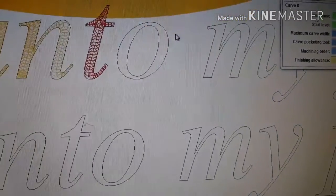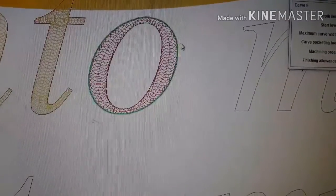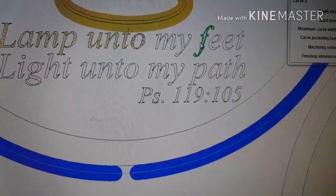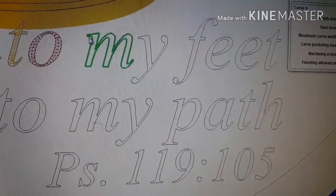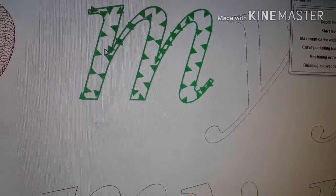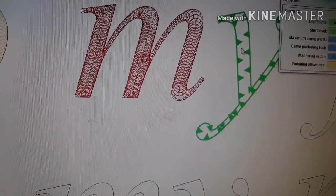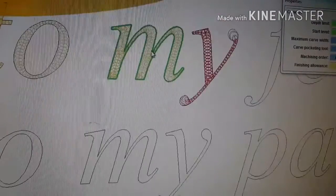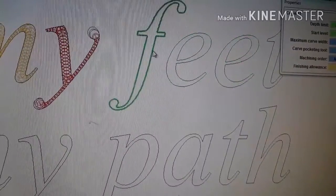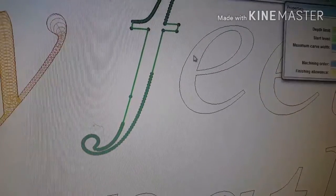And if you don't know what the carve feature is, it's a feature that probably gets used the most for this kind of stuff, like signs. This is a really good example because these letters are tiny. The carve feature can use a V-bit because, if you think about it, at its very point the V-bit cuts very lightly.